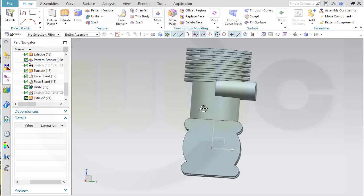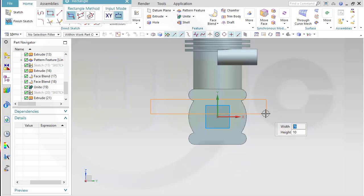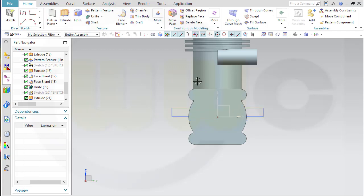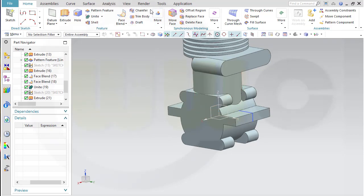One thing is missing. A rectangle which is 6 by 60 — so 60 by 6. Align it at the midpoint and that point should be coincident. Finish the sketch. Make an extrude, make it symmetric — that would be 16.75. And unite. Hide the sketch.